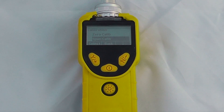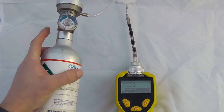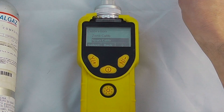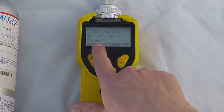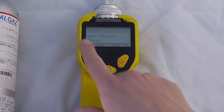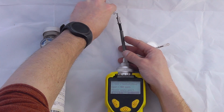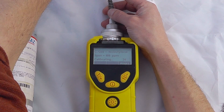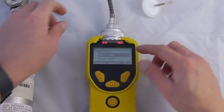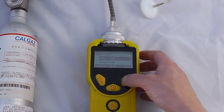We then get an option to span calibrate the device. For our purposes here, I'm going to use a can of isobutylene with an on-demand regulator. Place that over the unit and remove the hydrophobic filter from the top of the instrument. Select span calibration and it'll ask us to apply the gas. In this case I'm using 100 ppm of isobutylene. For a ppb-ready instrument, you'd normally calibrate at 10 ppm of isobutylene. I want to calibrate at 100 ppm, so we hit no. It will then say please apply gas one. The on-demand regulator automatically registers and does a 30 second calibration. We can see we're reading 102.1 parts per million — span has now been successful. Remove the instrument from calibration gas, and that's our two-point calibration done.